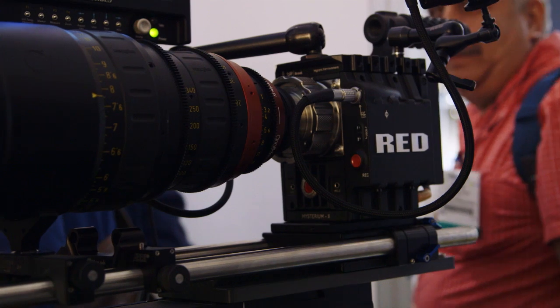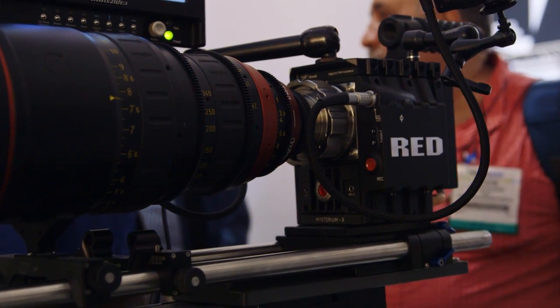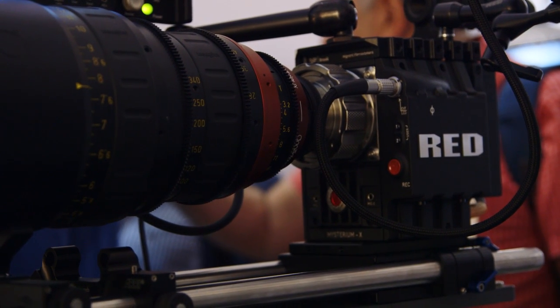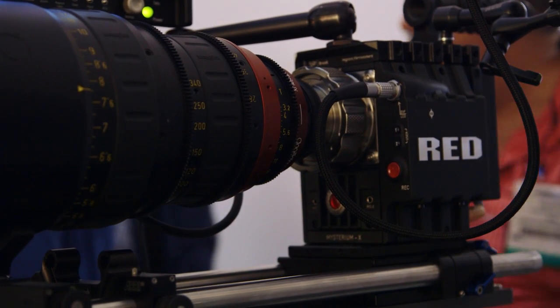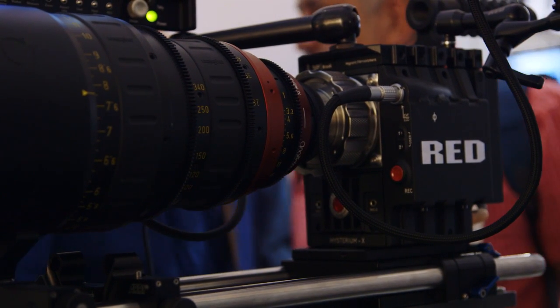We're here with Jean-Marc from Angenieux, and he's going to tell us about the new 5K lenses they are just announcing. So the 28-340 has been designed to cover the 5K sensor of the Red Epic with the current 24-290. We have image cut at wide angle, so that was the limitation for using that lens full zoom. And so by adding a rear adapter, a 1.16 time adapter, we cover the 31.4 millimeter of a Red Epic.